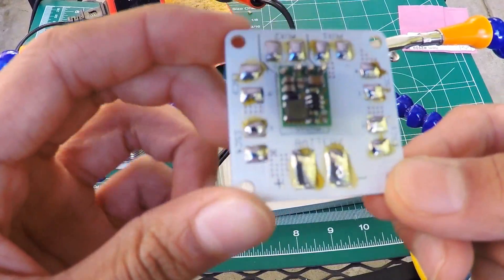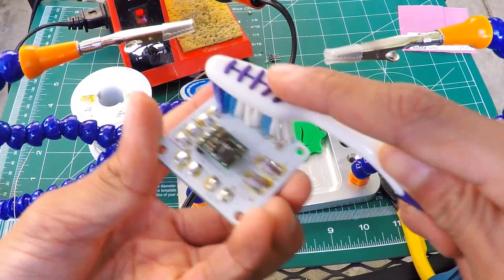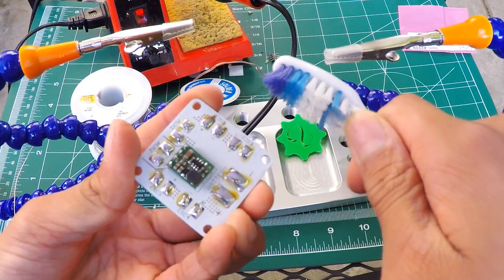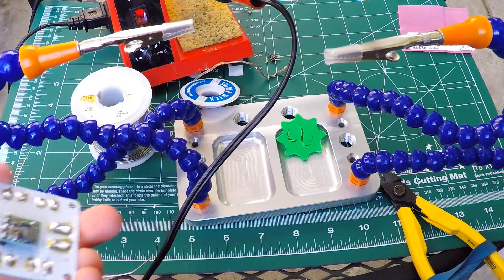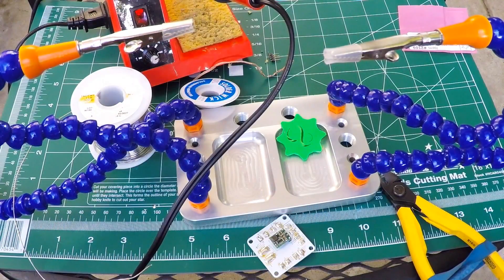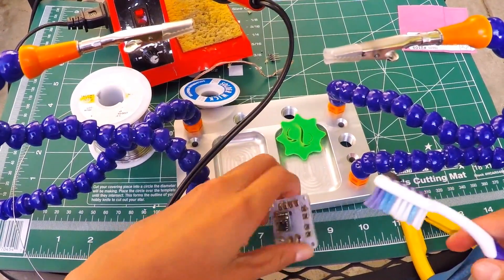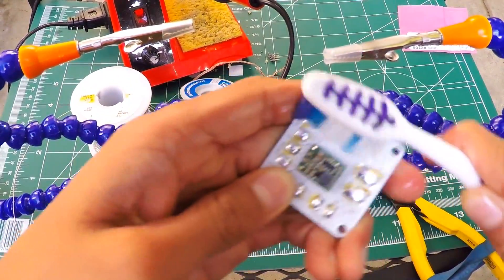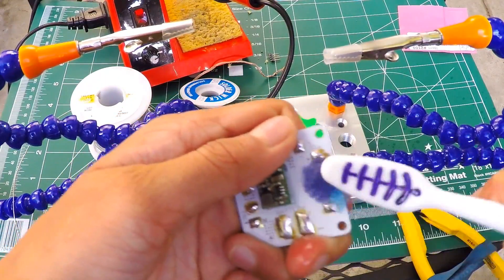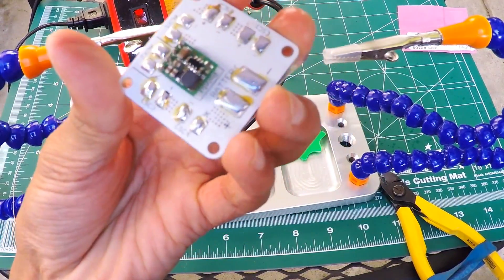As you can see, I'm all done, and there's that yellow flux again. Once again you want to scrub it with rubbing alcohol — isopropyl alcohol — soak the brush in that stuff. Just to be clear: not the alcohol that you drink, the rubbing alcohol. A few scrubs and the yellow stuff is coming out.